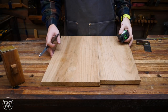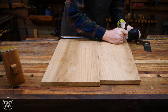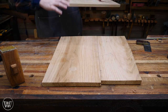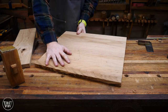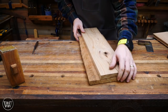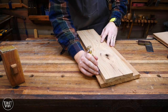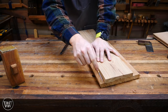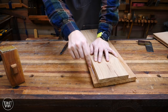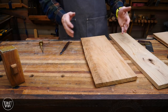So I just finished jointing this edge — I have a really nice, smooth, true 90-degree edge right here. This is my reference face for the rest of this board. I'm going to come off this and make a mark at 18 inches on both sides, then grab a straight edge and connect those marks. I'm having trouble with the straight edge sliding around, so I'm going to use an awl instead of the marking knife. The awl leaves a slightly wider line, but going with the grain it doesn't want to follow the grain as much as the knife does. I do a light pass, a medium, a heavy, then one more for good measure. Now I have a good line to follow, so I'll take this to the saw bench, cut it down, joint it to length, and now my table will have the right width.